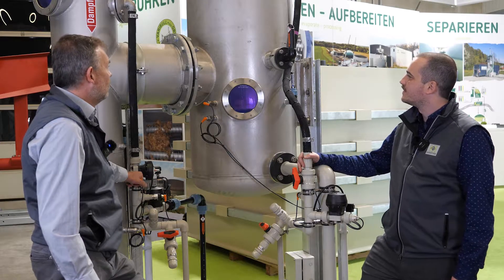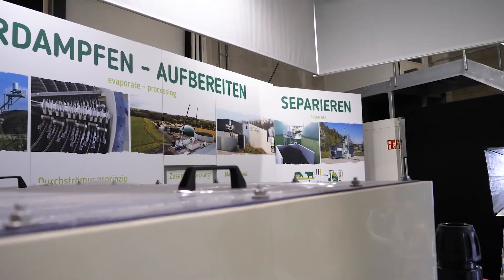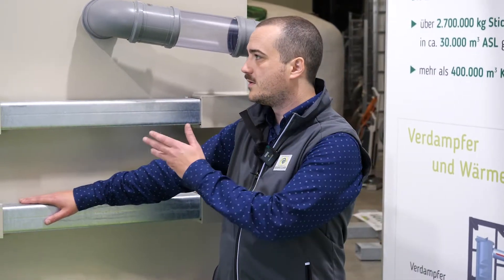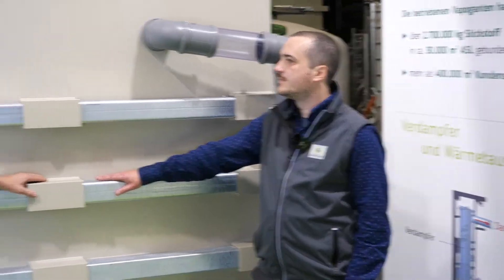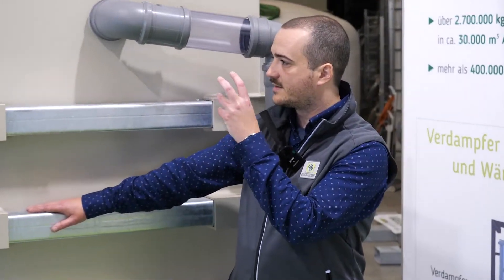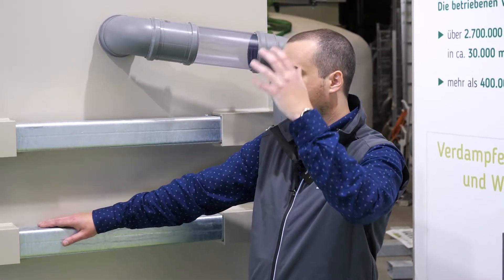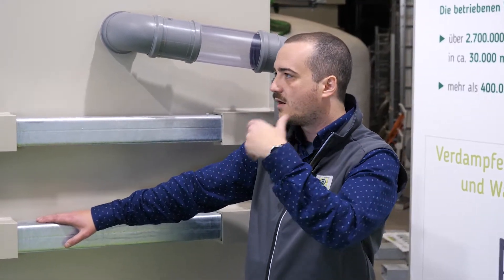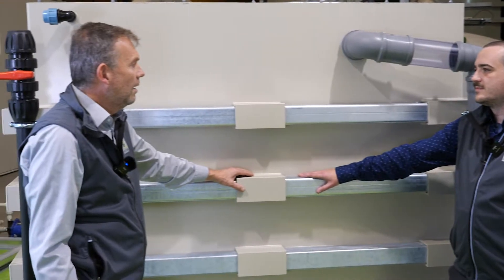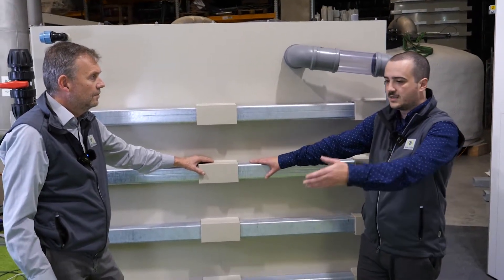Could you tell me what we are doing with this steamed water? Yes, of course — follow me. So this is our condensate treatment module. Inside of this is activated carbon, and the activated carbon cleans the condensate coming from the vapor scrubbers and the condenser. It removes all the little bit of ammonia and COD that may be inside. That means afterwards we have totally clear water — clear water you can use for washing machines or cleaning the stable, whatever you want.